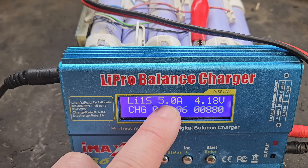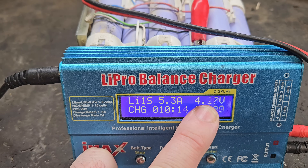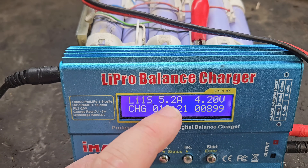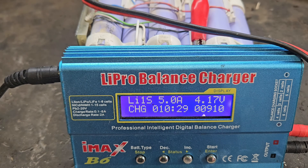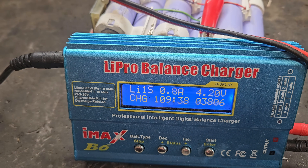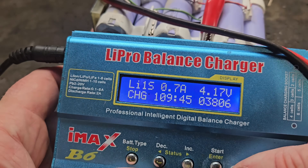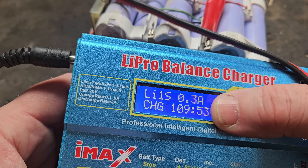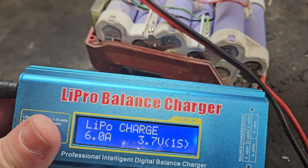I haven't changed the settings. You can see the amperage has gone down a little and the voltage is up to maximum now — 4.2 volts. As you get closer to 4.2, the amperage will drop. That's 10 minutes so far, so not too bad. That's now 109 minutes — I know, that's a romantic comedy you could have watched instead. But see, it's gone down to low amperage. It's taken a long time, but I'm going to switch it off now and check the voltage of this bank of cells we've charged.